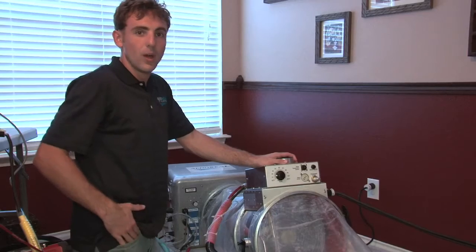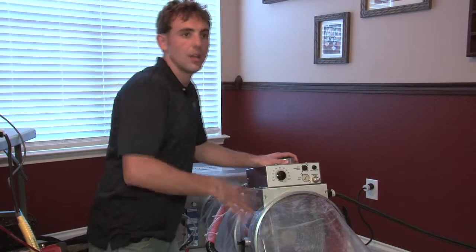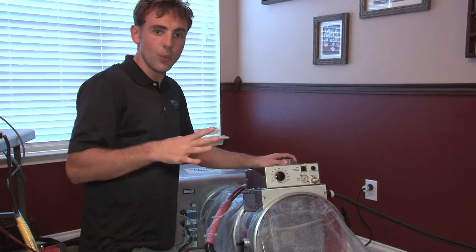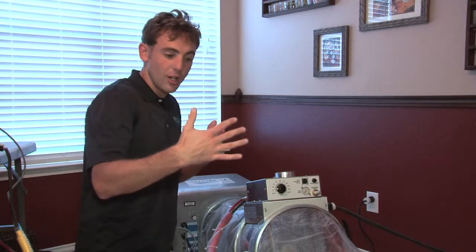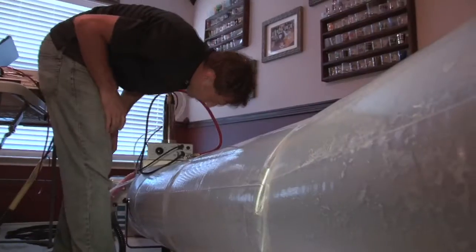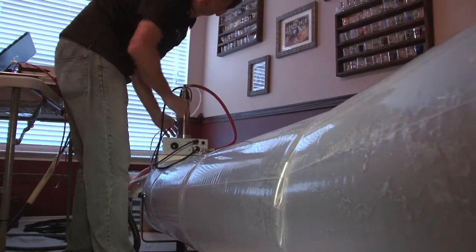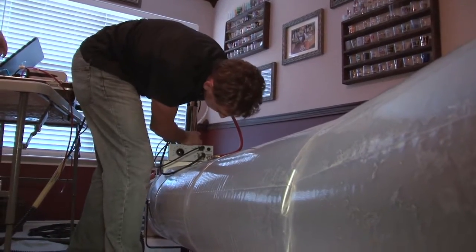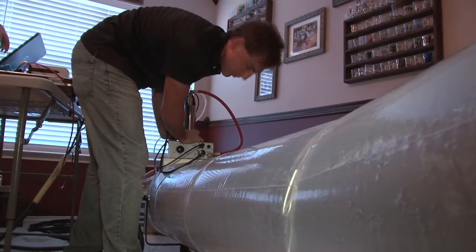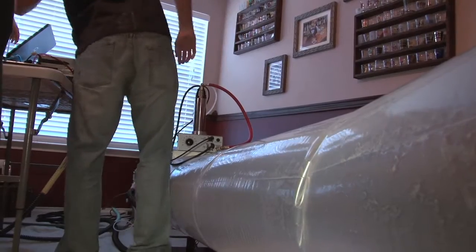Basically, when the glue becomes airborne, it goes into the duct system, and whenever there's a difference in pressure and temperature, the glue then sticks to the edge of wherever that hole is, and the glue can then start building up on itself. And you'll see in the demo plenum that we have where the glue will start slowly building on itself and start to solidify.